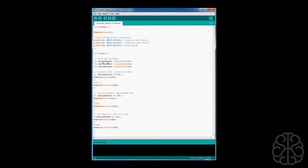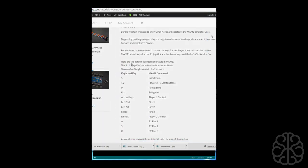In the main loop we first check the switches to see if they're activated, putting the values into variables: buttonState2 equals digitalRead of pin 2, and similarly for pins 3 and 4. These hold LOW or HIGH depending on whether we're pressing a button or moving the joystick. There's also a reference table on our tutorial page — for example, keyboard key 5 is insert coin in MAME, key 1 or 2 is player 1 or 2 start, and so on.